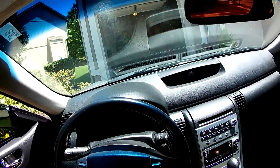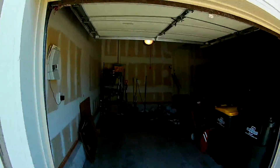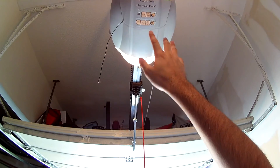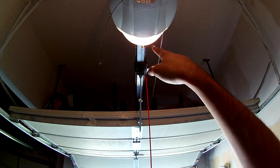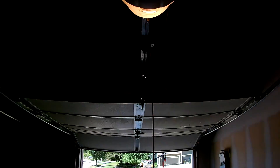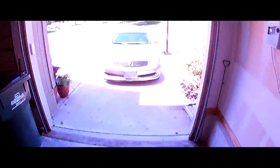You're gonna have to get out of your car and go to your garage door machine. On the machine there should be a little button that says 'Learn' and then 'Code.' When you press that button, you have 30 seconds to run back to your car and hit whatever button you chose as your garage door opener three times.